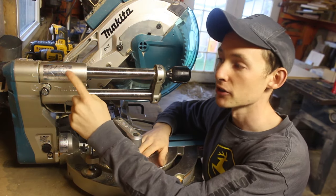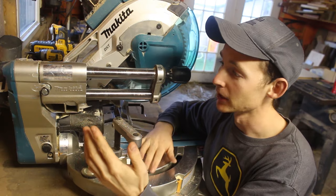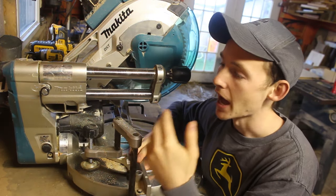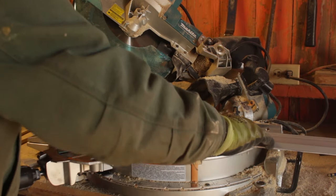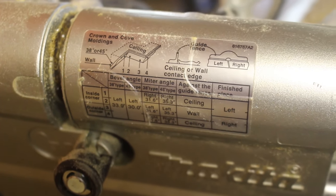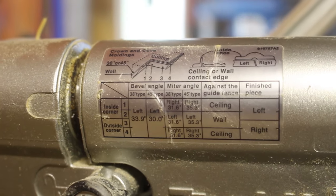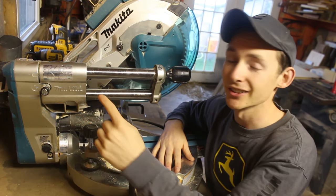I also want to mention this crown chart. I recently had to do crown for the first time in a while, and while I wanted to cut it nested I didn't have the right jig set up. So I ended up cutting it flat on the table, and honestly it turned out great. All I had to do was follow this handy chart, which tells you exactly which way to bevel the saw and how many degrees to go for an inside and outside corner. All my joints fit amazingly. If you don't cut crown very often, you're not going to remember those angles.